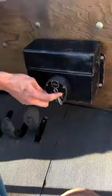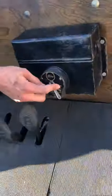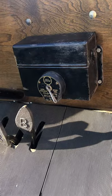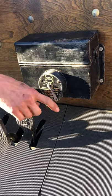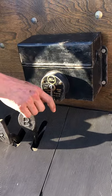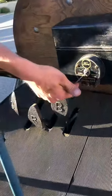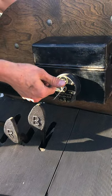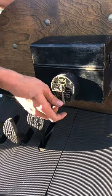Spark coil over here — this is your run position. Since it does have an alternator in it, if you leave it in this position, it will charge the battery too. Back in the day it was more of a generator, so you'd have to crank this thing hard and fast to get it to fire up. It still runs in that position, but it runs really rough because it's not designed for it anymore. It has an alternator now — it's more of a drivability thing.